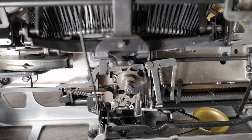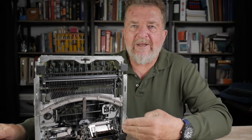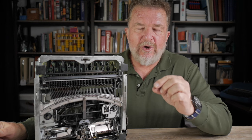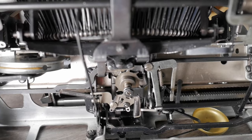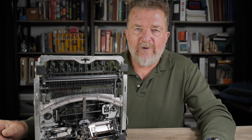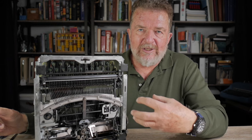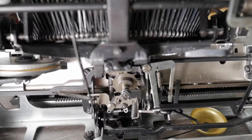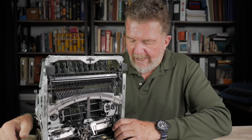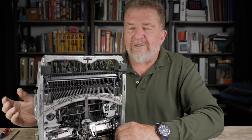The spacebar works fine now. I can't stress how dramatically different the typewriter performed after replacing that small piece of rubber and getting both dog levers tightened down properly so they move freely without wobbling. Once I reinstalled the escapement the machine operated perfectly. Before, as the rubber wore out, the escapement would intermittently lock up — the carriage would lock because the dog lever points were caught on each other and on a star wheel tooth simultaneously. I also had to do a little adjustment to the lowercase position.